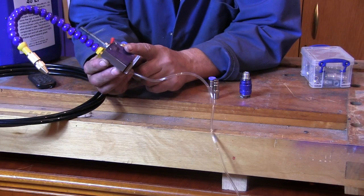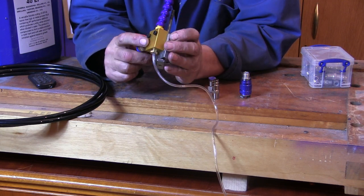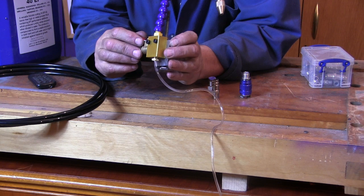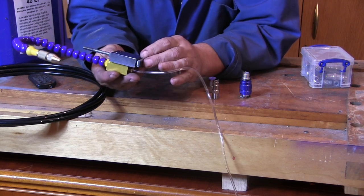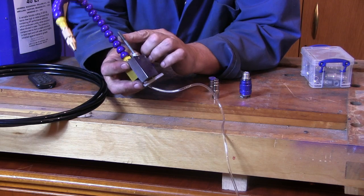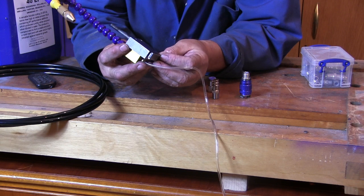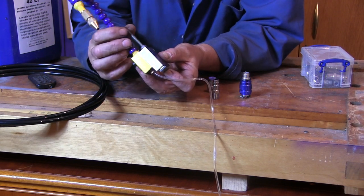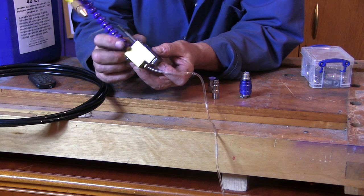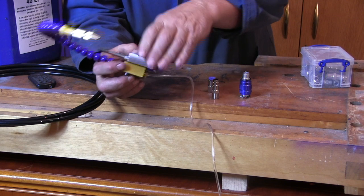Right, so here's the steel block in place with the spout and tap screwed to it, with just some little M5 cap screws. You might be forgiven thinking I've left the stud on this a bit long for the T-nut, but because I'm too bone idle to make one at the moment, I've nicked the one off my rear tool post, so I can try it out. But I will get around to making one for it.